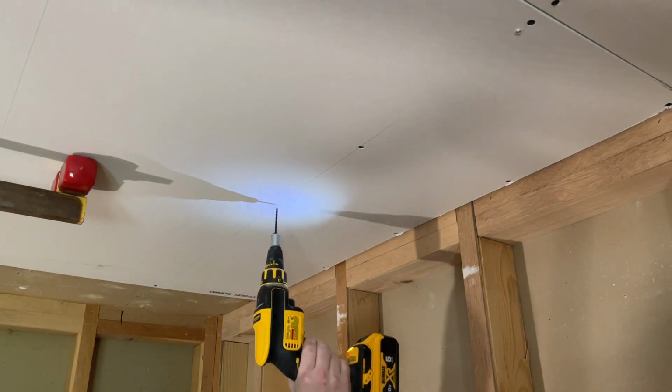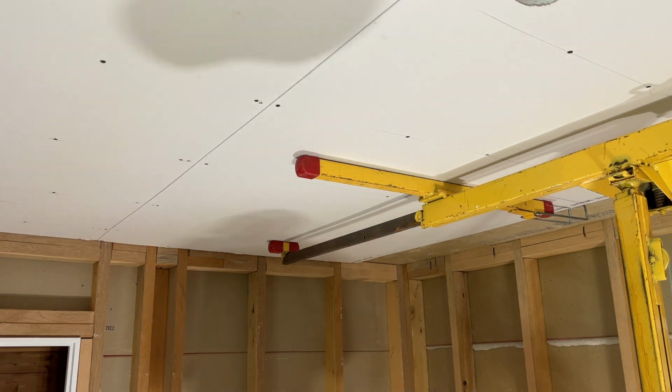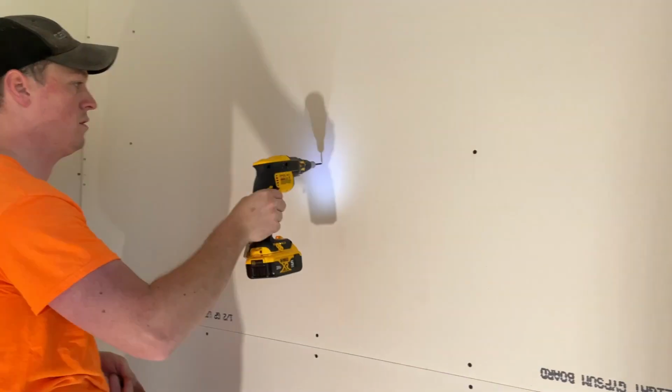Now for the big transformation with new drywall. I got 14-foot long sheets for the long walls and ceiling, so I wouldn't have any butt joints to mud at all. The long sheets were a bit of a workout working alone, but I got it done nonetheless.